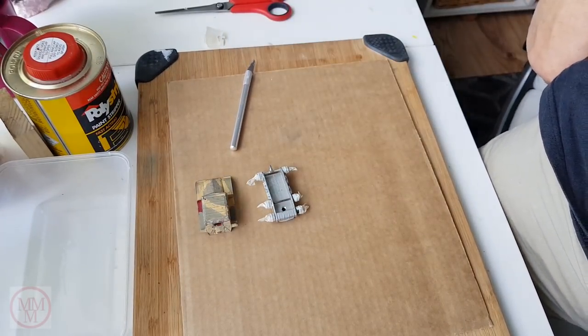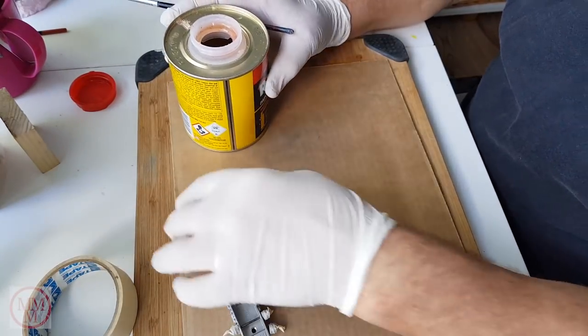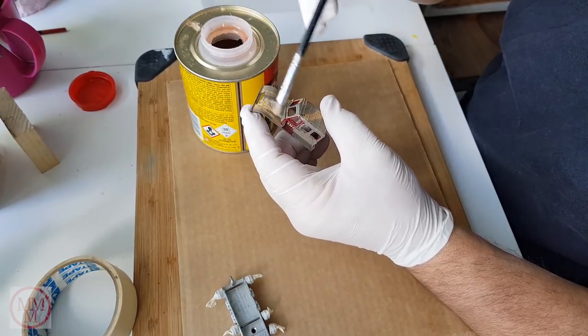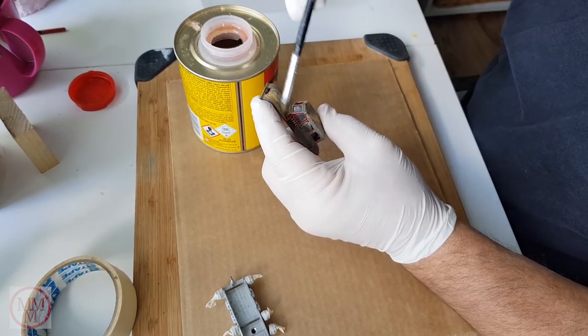I use a tried and tested product called Poly Stripper. I find it works on all paints and is very fast. I recommend using rubber gloves if using any form of paint stripper, as they can burn if they get on the skin.